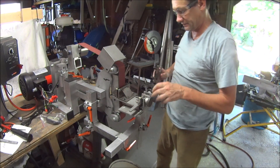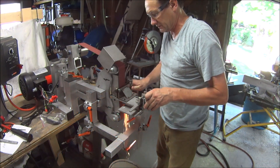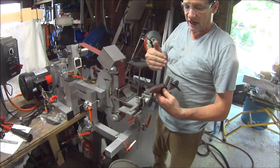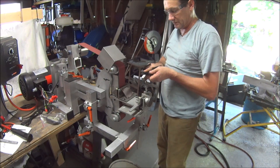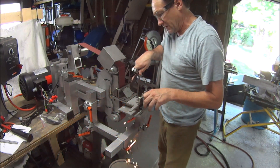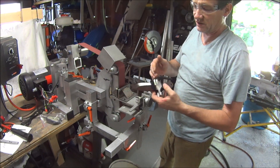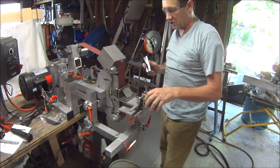It's progressing up there — very quick, very nice. I'm running about 5000 surface feet per minute. I monitor the whole time in case for some reason I need to change a setting so that I don't over grind, so I keep an eye on it. I can take off a lot more, but because this is an unfamiliar knife — my first grind on this knife and it's a customer's knife — I'm taking it kind of easy, just a thousand or two thousandths a pass. If you're doing a batch of knives and you've got it figured out you can go a lot faster with the right belt and the right machine.